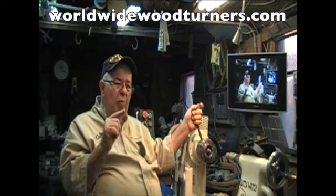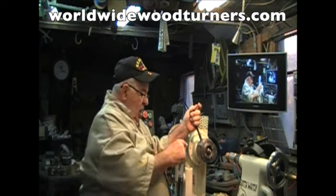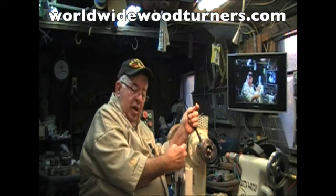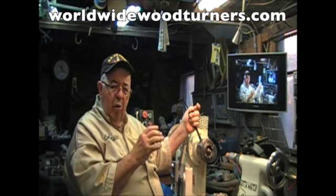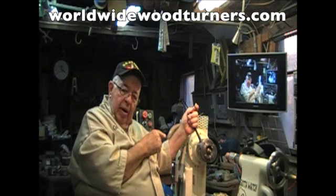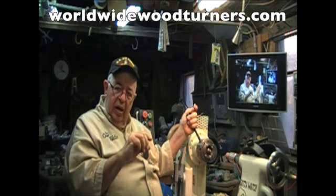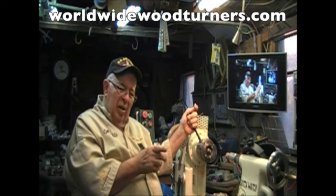A little bit of problem. Just a little. The energy to squeeze the jaws was compacting on that Morse taper, right? And you had hardened jaws against a hardened other. So you're going to get minimum slip, but when you do, it's going to be a biting slip. All right. Number two, it's a Morse taper. At what point on a taper do you think you have a good uniform setting? It ain't. Your taper doesn't match their taper, their taper doesn't match your taper. Not a brilliant idea.